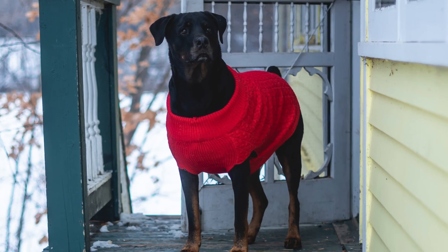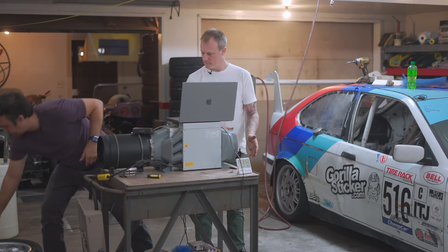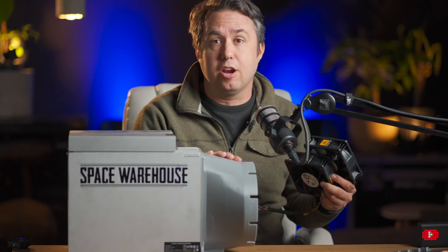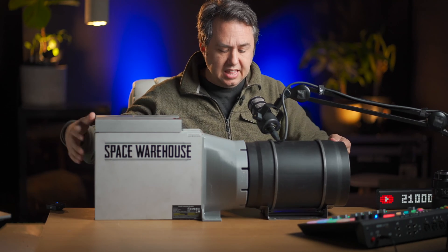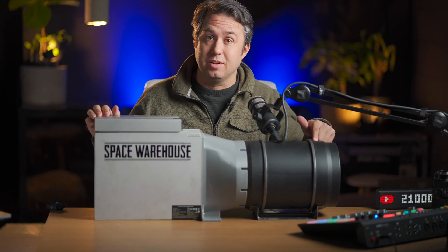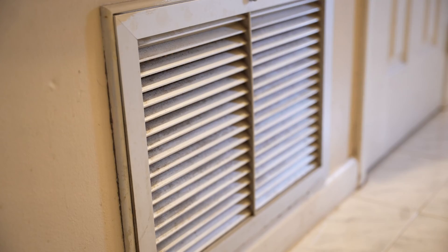I have a dog — he's a good boy, but he also puts a lot of hair in there. Using the system I assembled to heat Joe's garage and also to quiet down all my Bitcoin miners at the warehouse, this 3D printed shroud allows you to replace the four high RPM, pretty noisy fans that come with a Bitcoin miner, and instead use this large, slower RPM, sleek inline fan, and these four little chippies that make the miner think it's running the way Bitmain intended. Bitmain, it's time for a redesign — this is way quieter and way cooler. It also allows you to send the hot air where you want it to go, and I want it to go into this vent.